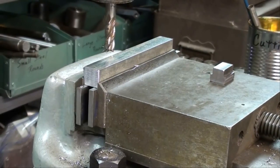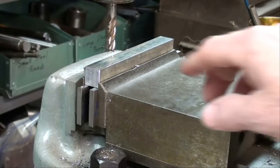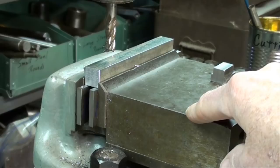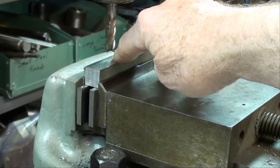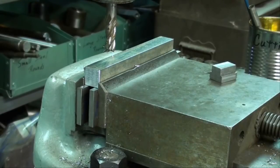I didn't do any layout on my work at all — you certainly can do that, but I'm basically doing my layout on the machine itself. The work is secure. I have a three-eighths end mill in there and I'm running it at about six hundred RPM. In order to take this down to six hundred thousandths, I only have to take off twenty-five thousandths off one side. The tolerance isn't that critical, so if I'm within about five thousandths of what my drawing calls for, that's perfectly acceptable. I'll turn the machine on and slowly raise the table until I touch the work, then zero out the crank on the knee and crank it up twenty-five thousandths.